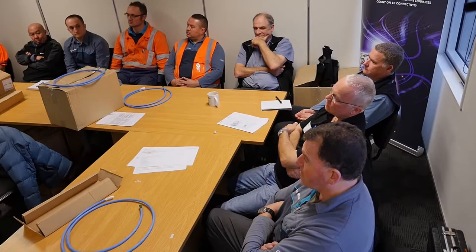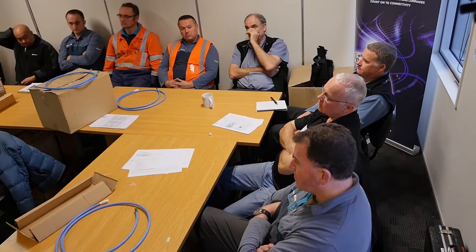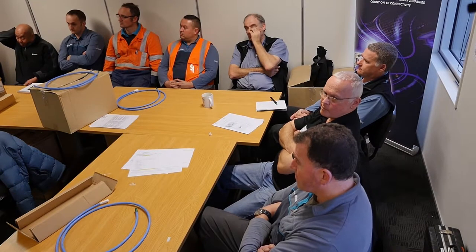As an installer, we need to be told whether we're reinstating fireproofing or not. My understanding was any new penetrations we put in had to be fire stopped. Yes, but any existing penetrations, we leave as we found them. So if there's no fireproofing, then we don't fireproof it, if the consents say that. As the installer, we need to be told this. If the building owner agrees that we do not reinstate it, then it's fine, we'll do it. If they do not agree, we walk away. Then we need to see something in our document telling us what we're doing. Yes, the consents team will have to provide you with that information.